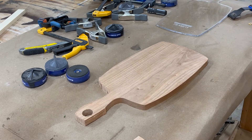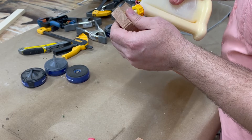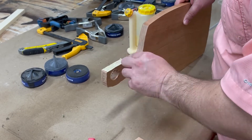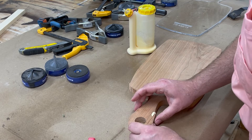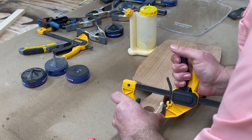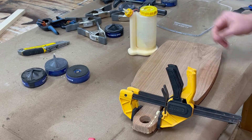A little bit of good news — it did come off just in one chip, so that's an easy fix with some wood glue. I'm going to take that acrylic off, get some wood glue on there, put it in some clamps, work on a few other boards, and come back later after that dries. Just a nice, easy fix — a relief that it was just the one piece.